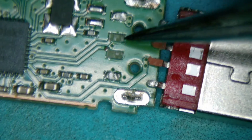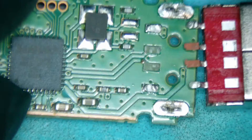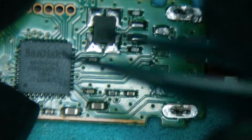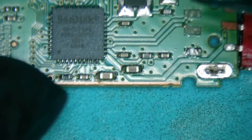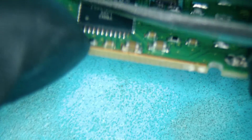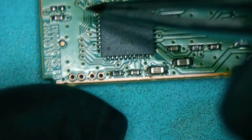Now when we see something like this, normally we think one thing, but now I can actually see it and we think of another thing. Some of the pads have actually been removed here too. Most likely because it's been opened before, maybe there was a struggle and it actually ripped up the pads here too. What we might have to do is create little jumpers to help connect to it. These two are pretty important because they go directly to the SanDisk controller here. When you have a problem like this — especially if it was working and you try to plug it in — it can damage the controller. But since it's been opened before, you can't always rule out all the possibilities.